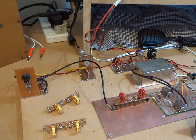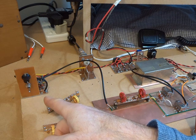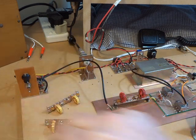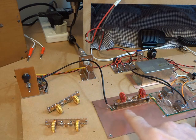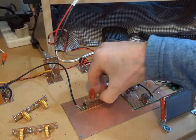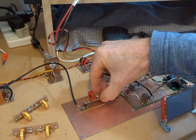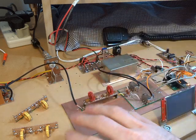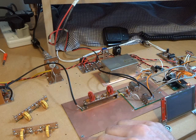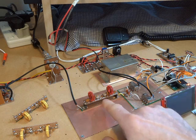On the left hand side here we have the RF amplifier. I'll quickly touch on how that was finished off in terms of that variable pot. We've got a bypass switch there — up is off and down is actually in the circuit. It's now coming through, as we described the other day, into the bandpass filter. At this stage I'm going to play around with having removable plug-in filters as opposed to that single variable capacitor feeding three filters all in parallel with relay switching. That configuration actually worked quite well and was very similar in performance to the individual filters.